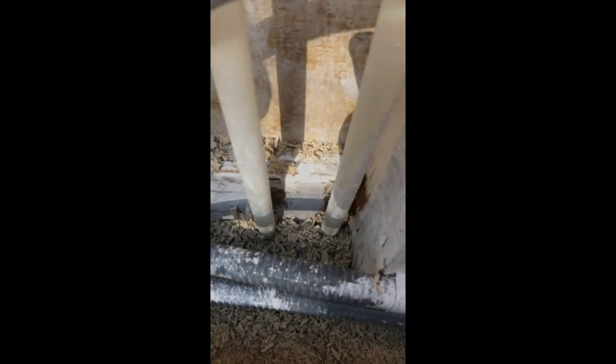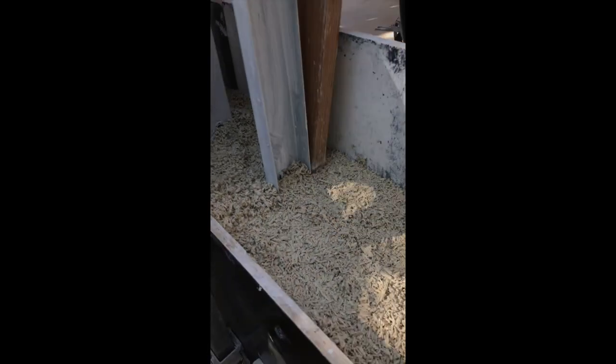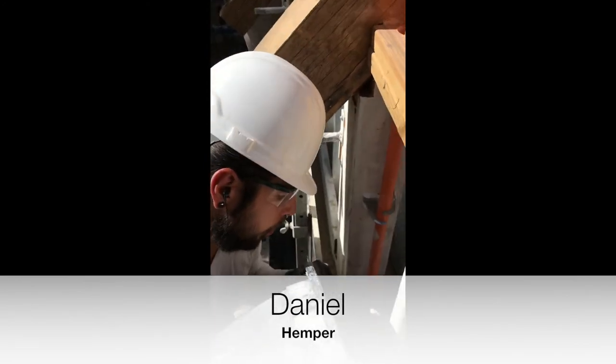Working around these pipes, making sure that in these gaps you've really got to get in there and make sure you get the tamping done right. Because when you strip your forms, you want to just ensure that you have full compaction. And then leaving the center of the wall still quite nice and not as hard in the center, so that we still get good insulation. And then we have stuff on the outside.